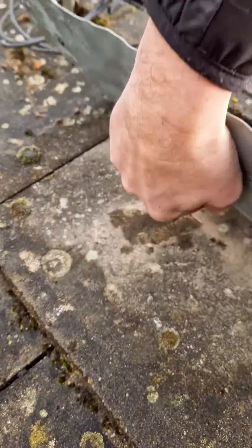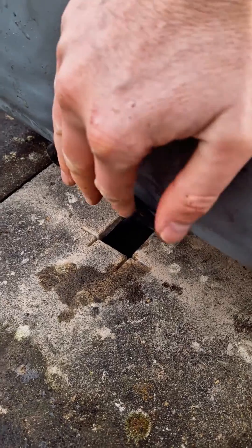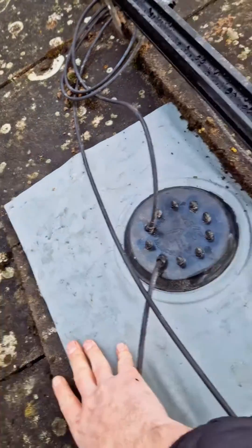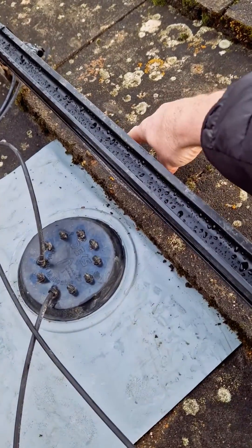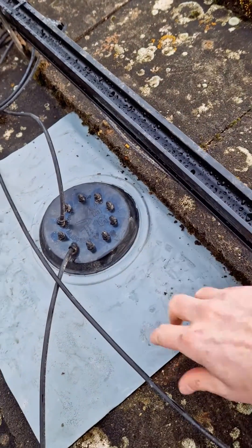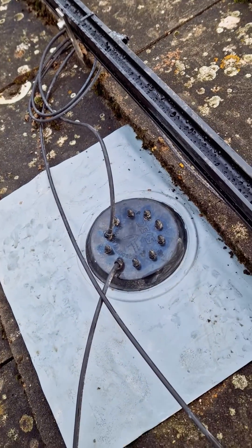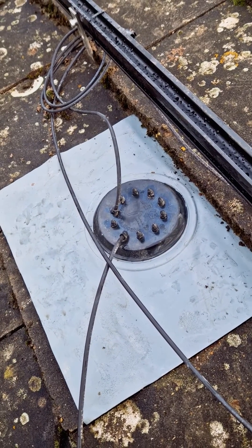If I lift this up, as you can see underneath there's a small hole that we cut, and then this sits down on top — it's nice and wide so the rain can't get in from the sides, and then the top is lapped over a batten which stops it sliding out. And there you have a deck-tight cable entry which is in accordance with the MCS regulations.